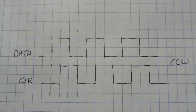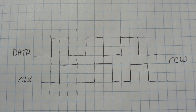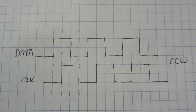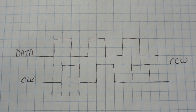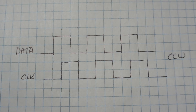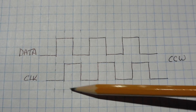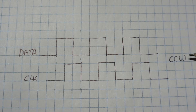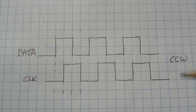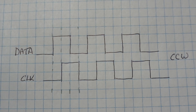Before continuing, I want to clarify: the circuits described in this video are for experimental purposes only, to get familiar with the workings of a rotary encoder. If you wanted to build your own product using a rotary encoder, you'd go about it differently. The clock and data lines would be fed into GPIO pins of a microcontroller, you'd set up an interrupt service routine on each GPIO pin, and then write a finite state machine — because there are four states to go through for each step. That properly handles contact bounce and half-steps. I've made a video on finite state machines and will link it in the description.